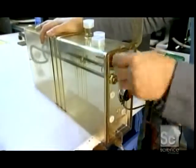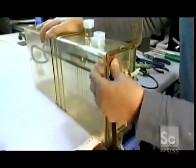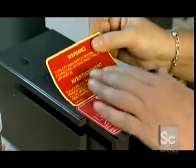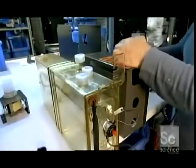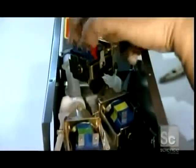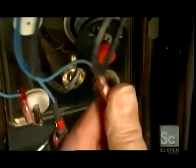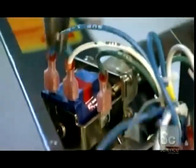That's the optimal temperature for extracting flavor from ground coffee beans. After applying stickers warning service technicians to turn off the machine before draining it, a worker installs three outlet valves — one to dispense hot water for tea, one for coffee, and another for hot chocolate. Next comes stainless steel rods to monitor the water level inside the tank. They trigger an automatic refill mechanism.